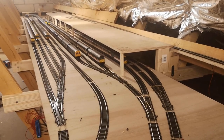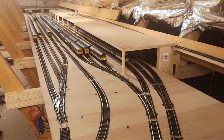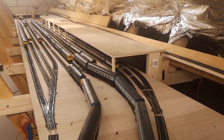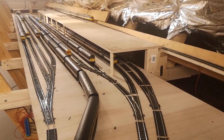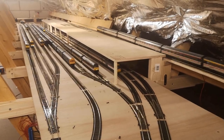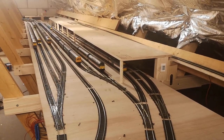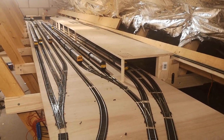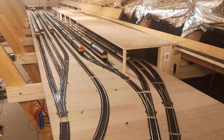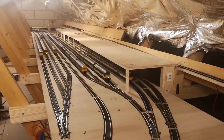The other really weird issue I can't get to the bottom of is that every now and again one of the Arduinos, when I switch it on, its sensor values as JMRI sees them are all the inverse of what they were last time I had the layout on. This has happened two or three times - every single set of points in JMRI for that corner is wrong. The sketch hasn't changed, I've done nothing in JMRI, and I'm pretty sure I saved the JMRI settings. Every single one is the opposite of what it should be. It's fixed simply by going and changing the inverted status of each of those sensors, but I have no idea why it's happening - that one's still to be investigated.